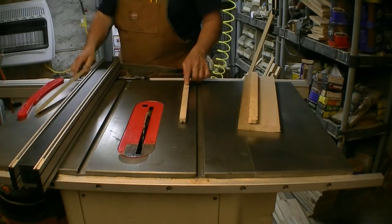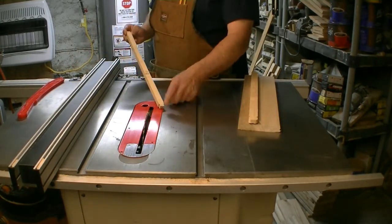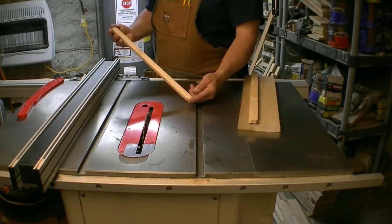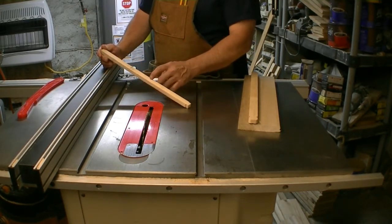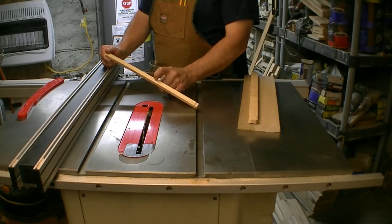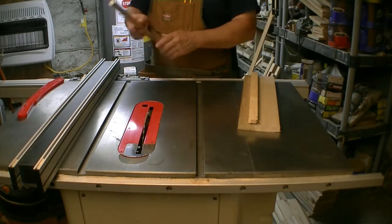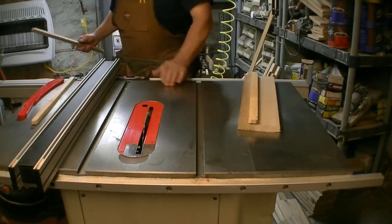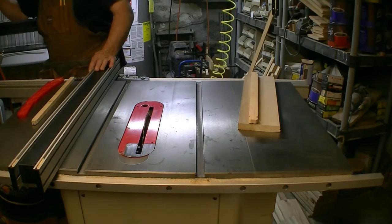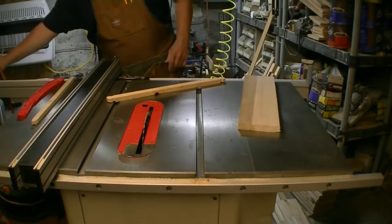And let's see if we find the other one. Here was the original bottom rail, and the bottom rail measures across top to bottom 17 3/4 from top to bottom, 3/4 inches here on the top, and then on the side will be 1/2 inch, and then just your little cuts here. So let's see. We'll just go ahead and measure again.